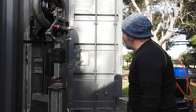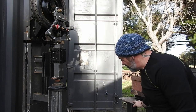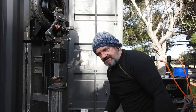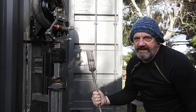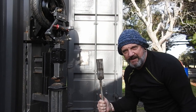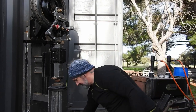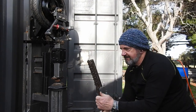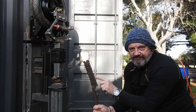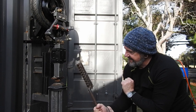Well, here we go. We've got the power hammer ready to go. We've got the Devil Forge ready and two billets. I have your standard 15N20 and 1084, but not done in an even pattern, uneven, so I want some big, wide bits on that one. Or we've got this one, which is some big chunky chain with some 1084 high carbon steel welded on the edge with the cutting surface.